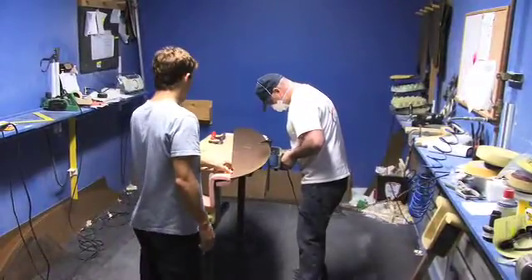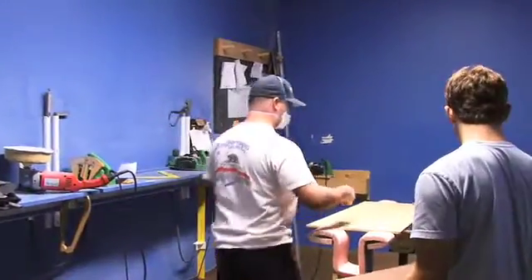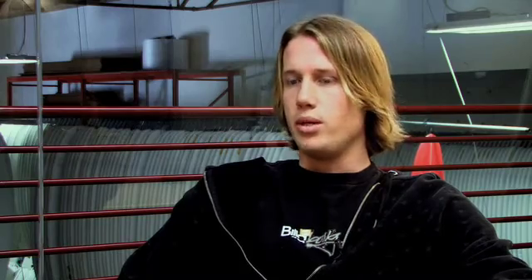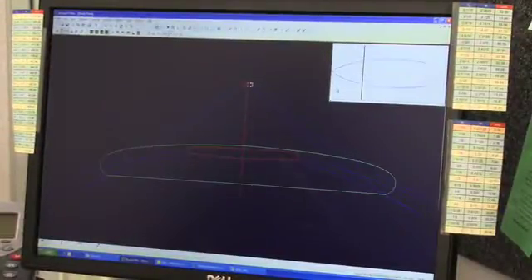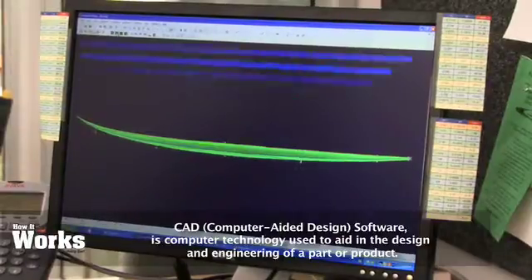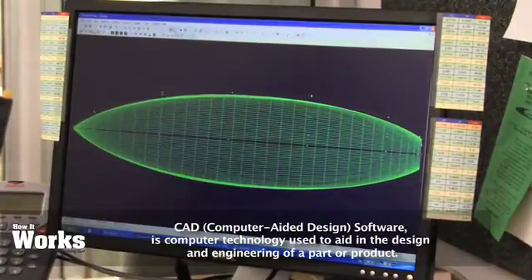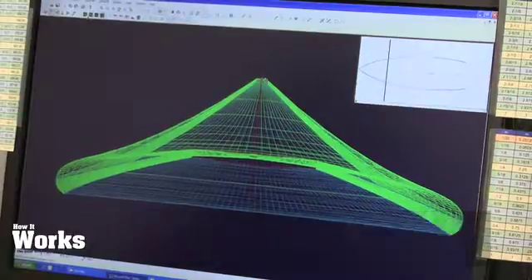There's the design aspect from the rider and the shaper and their ideas, which is usually communicated to me verbally. Numerically there are also a lot of measurements involved — calipers, thicknesses, and rockers of that sort. I take that information and use CAD software, where it's a matter of manipulating what they call control points, which actually control all the curves of your surfboard and the surfaces themselves.